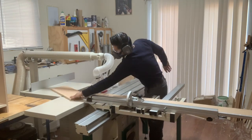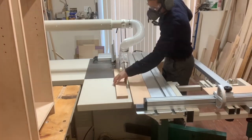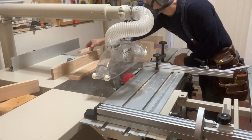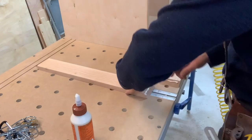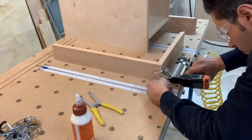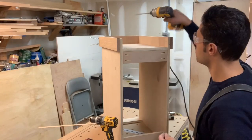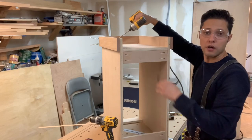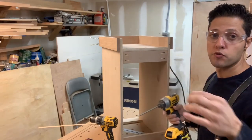Next I'll cross-cut the red oak for the base trim and rip it down to the size I need. Then I'll angle the blade to 45 degrees and cut miter corners so I can wrap it around the edges of the carcass. I'll apply glue to each one of the miters and use miter spring clamps to hold them in place while I pin-nail them — I'll have Amazon links to these tools in the description below. Then I'll join the front with pocket screws from underneath, using fine-thread one-and-a-quarter inch pocket screws because I'm drilling into red oak.